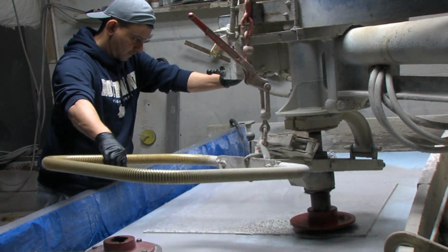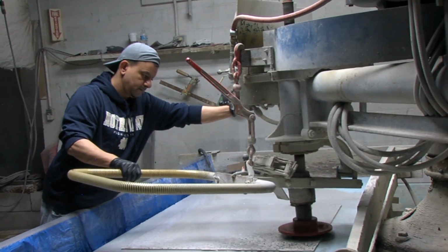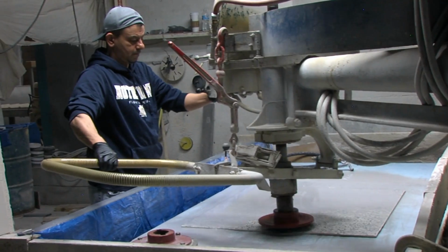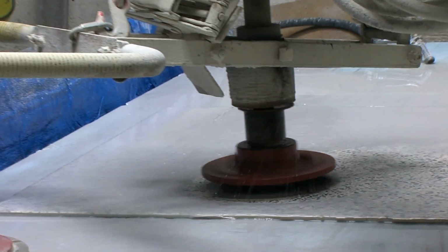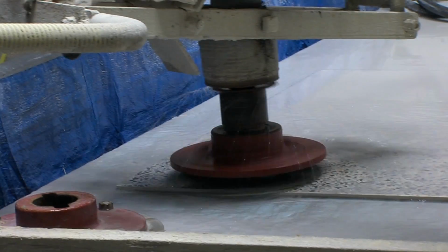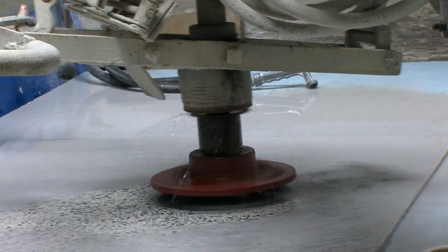Once the block is set, the pieces are set one at a time. They will be strapped back, and several different setting processes will be used, but mostly it's an air gap, and then there's a mechanical fastener that's used to connect the stone to the block. Kind of like a brick tie when they put up a brick wall. It's pretty much a brick tie, exactly. So just one at a time, all the way around.